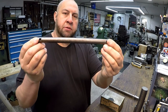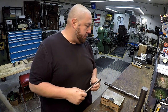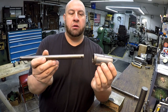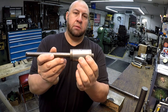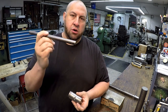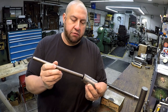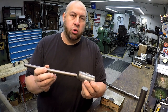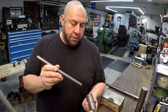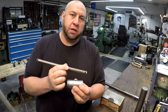I'm going to be using a 5/8 bar — this is a J.H. Williams 5/8 bar, a good bar right here — and this will give me enough clearance to go through there and machine that thread. I always like to go as large as I can. Three-quarter would have been better but it just wouldn't give me enough room for the bar and the tool bit to clear through the nut.